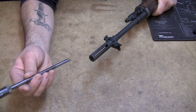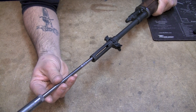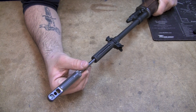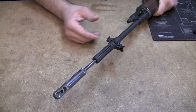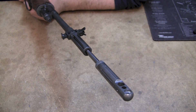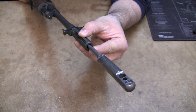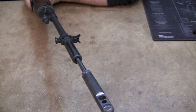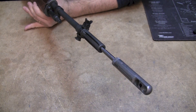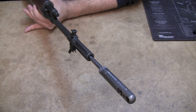This is a very quick and easy check. All you're going to do is get your flash suppressor alignment gauge and gently slide it into the flash suppressor so that it goes in just a couple of inches. All we're looking for is that there is no contact between the gauge and the orifice of the flash suppressor. You can go ahead and just rotate it around and see that it's pretty even. And that's all you really want to do.